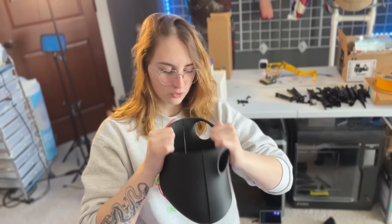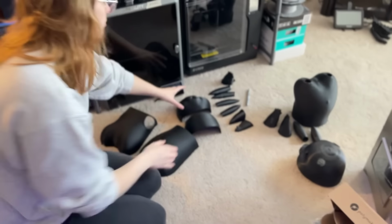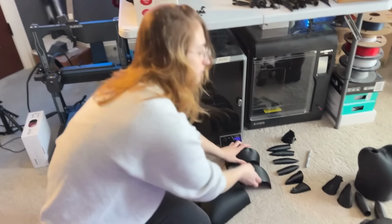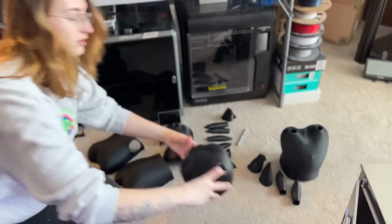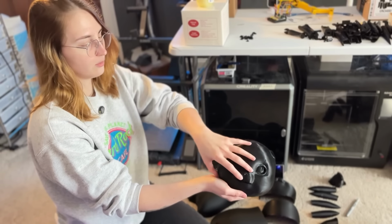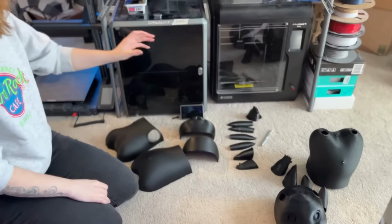And we'll fill this with Ultra Cal, and that'll be the underskull for the torso. Same thing with all these parts. They just get closed up and filled, so we can bake the underskull inside of the mold. These will be the skin molds. So we'll build an Ultra Cal mother mold over this, with the seam and everything and the keys. This underskull will fit into that mold, and we'll just bake it in that oven.